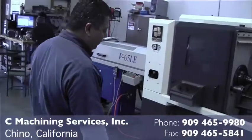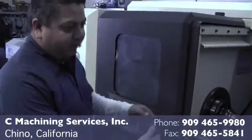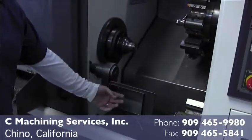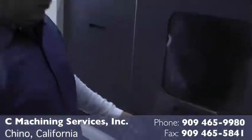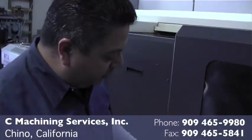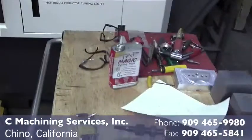It has a parts catcher, so every time the machine part ends, it'll part it off and cut. We don't have to stop the machine — it just continues production. Just grab the parts out, put them outside, and we're done. Just let it run all night.